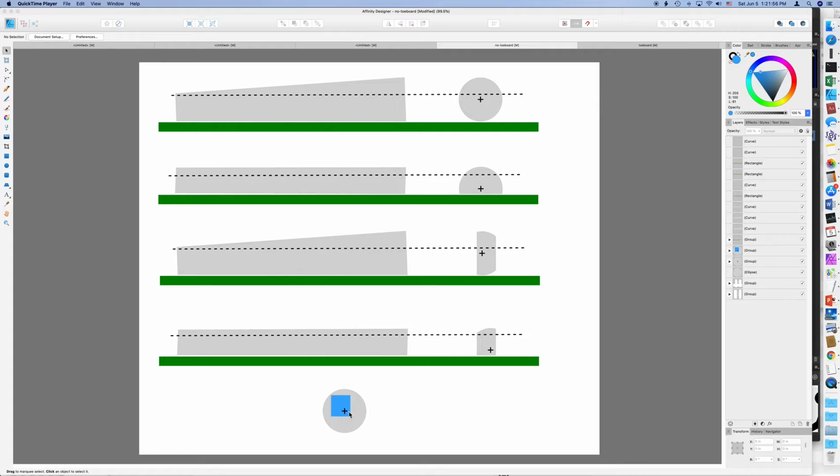Whether or not you use this as is for a post or a beam, or you may be going to slab it into boards or cut it up into framing lumber, being that out of whack with the original grain of the wood really is going to cause the quality of your lumber to suffer. And so that's very undesirable.